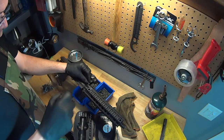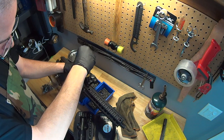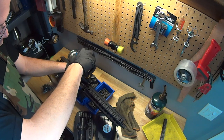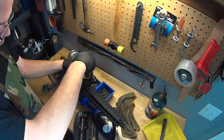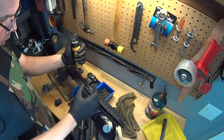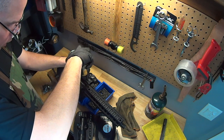And every time that it rotates, you should just be allowing it to rotate right between your fingers so that it's not skipping off of that screw. Everything that you do here is done in a slow and controlled fashion. There is nothing about an AR-15, or at least a modern AR-15, that should require beating, unless that's just part of the assembly process, but when it comes to dressing a gun out, you should not be beating on anything. Slow and steady wins the race.